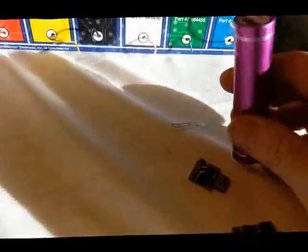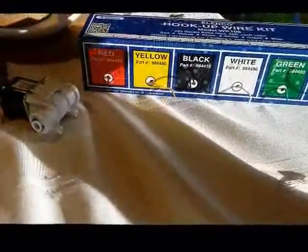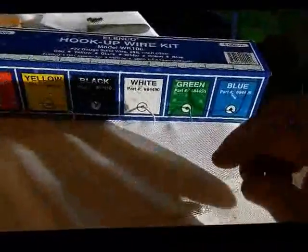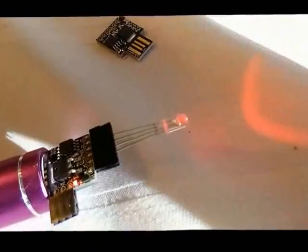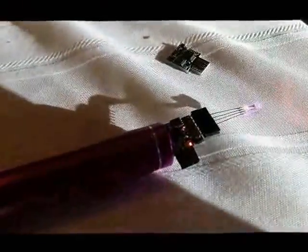Here's one of those cheap cell phone chargers from eBay. I stick my prototype board right into the end of it - there's my prototype board stuck in the end. Now the board's on. Let's shove the Digispark into the right holes - there we go, it's working. If you can see in the video, the LED is a tricolor and it's sitting there changing colors. That's kind of why I like these prototype boards - they're easy to check out and play with, easy to plug stuff into, and easy to program.